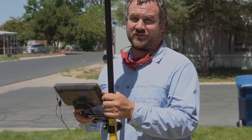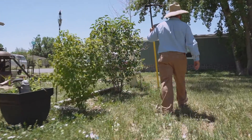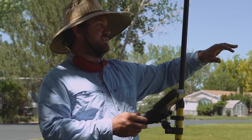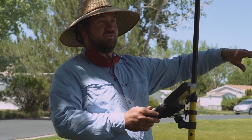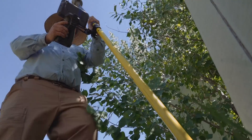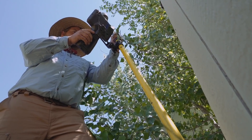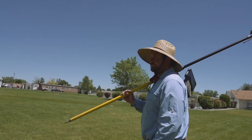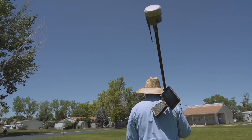I've taken thousands of shots out here and I think I've taken three shots where I turned the tilt off. In the past I would come through these corridors and set number five rebars with aluminum caps stamped as control points, then set the robot up and direct-reflect those corners. The nice thing about doing it this way is you get a good ground elevation at those corners, whereas if you're directly reflecting, your shots are maybe three or four feet up off the ground.